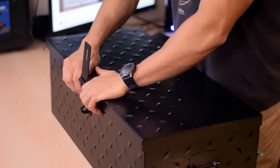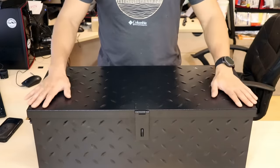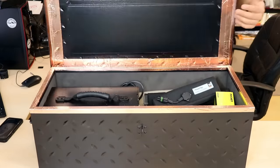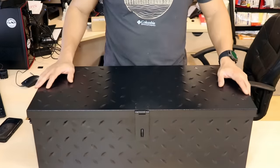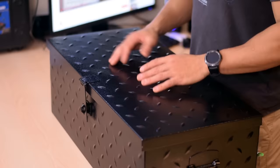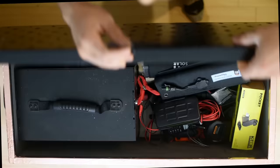I may still look into getting one of Dr. Arthur T. Bradley's gaskets that he sells on his website — I have no affiliation with him whatsoever. These gaskets have an adhesive on one side, foam in the middle, and a conductive aluminum or copper material on the other side, which adds a nice buffer ensuring a tight seal all around the Faraday cage. This is functional — I can open it and close it. He's also done tests showing that perforated or mesh-type Faraday cages don't protect as well, as RF energy leaks through any gaps in the exterior.